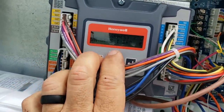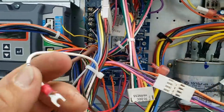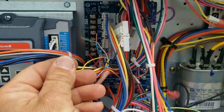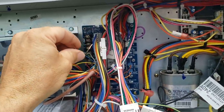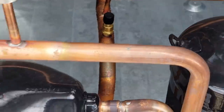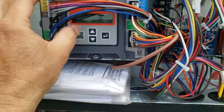The J controller has an outdoor air sensor error, which is great - looks like that didn't get hooked up. And it's even better when they just pack wires together in multiple different colors. I checked voltage on the yellow - got 23 and some odd volts - and 26-something on the blue one. So there's Y1 and Y2. We'll get this hooked up to see what she does. Both of them are running now. We've got some sweating going on, which is a good thing. Hooked our W back up there.